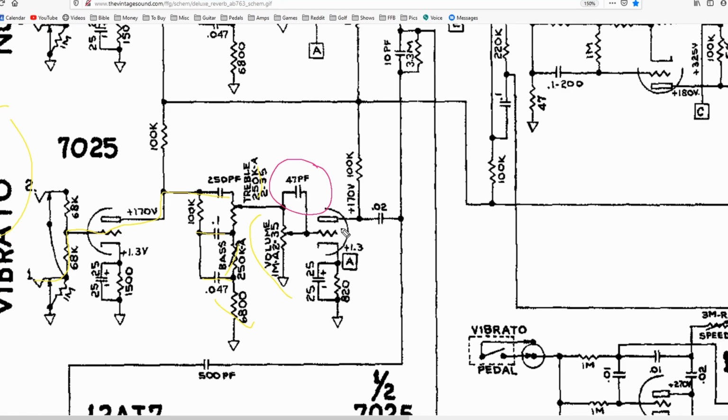First of all, on a very basic level, what a capacitor does is it looks at your signal, and if you want to think of your signal in terms of frequencies, you've got low frequencies, bass notes, maybe around 100 to 200 hertz. You've got mid-range frequencies, maybe up to about 1K, and then you've got high frequencies, treble frequencies, maybe 5K and up. So the capacitor will look at that signal, and it will identify the high frequencies at a certain point, and it will filter or select through them differently than the rest of the signal. So the value of the capacitor determines that cutoff point. But, for now, let's just say that maybe it's 5K.